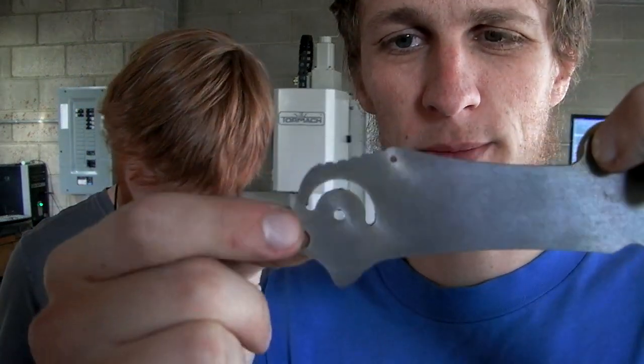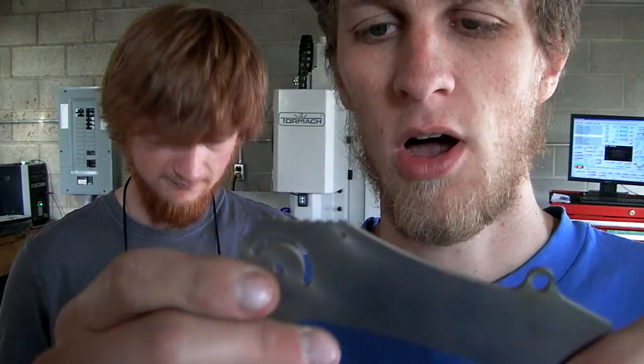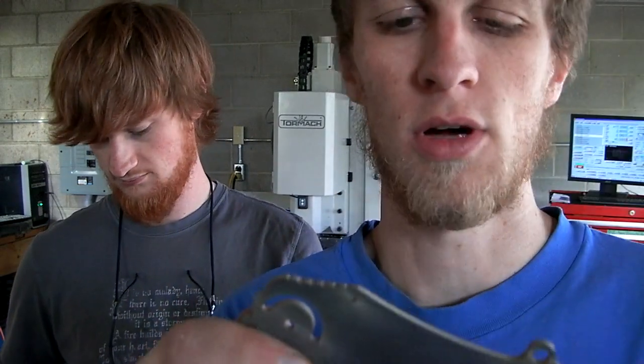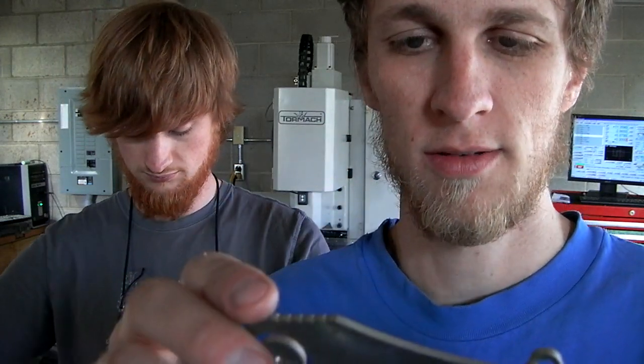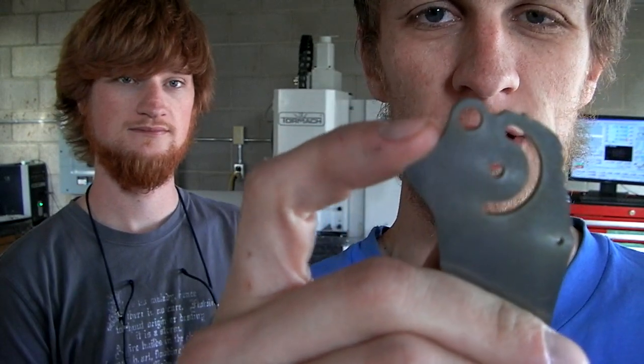Notice how I have tabs on here for mounting it to the machine — this is a long one, I'll explain that in a different video. All the holes are spotted, everything's undersized — the thing is 20 thou oversize so I'll be machining every surface. I decided to change to an internal stop pin, and I changed the flipper lever so it's got a very nice contour that fits the finger. Right now the handles are at the water jet place getting cut, should be done this week.